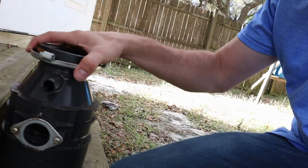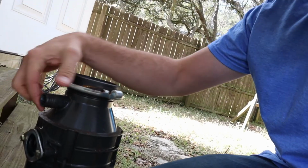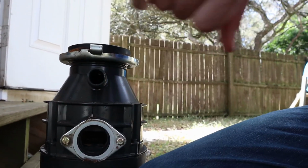The day after I filmed this video, I ran the dishwasher at the house and had problems. The dishwasher wouldn't come on, and then when it finally did run, it ended up leaking. Forgot one critical step, and I wanted to make sure that I told you about that. Remember when I was talking about this drain hole right here for the dishwasher? By default, it's plugged. There's actually a little plastic piece in here that is plugged up.